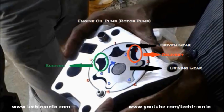The driving gear is the internal gear marked in blue. We can count the number of lobes of the driving gear: one, two, three, four, five, and six. That gear is rotating in the clockwise direction. The driven gear lobes are marked in red — count them as one, two, three, four, five, six, and seven. So it has one lobe greater than the driving gear.